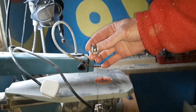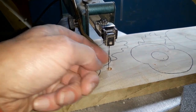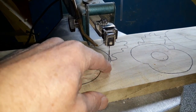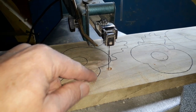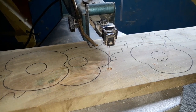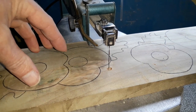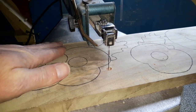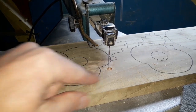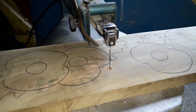Right, we're good to go. We've got that set up nicely with our blade. You'll notice I've drilled a pilot hole — that's literally to feed the blade through as we cut these out. I could come straight across but I want to try and keep this background wood as one solid piece as best I can, because we're going to need that for the poppies to sit inside while we go over the top with the router to start lowering the poppies and leaves down. That just keeps it more solid.